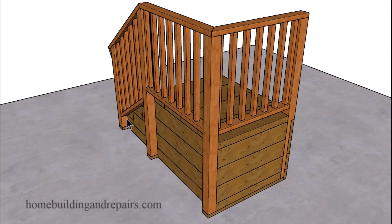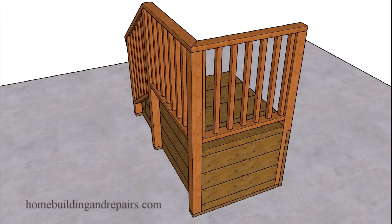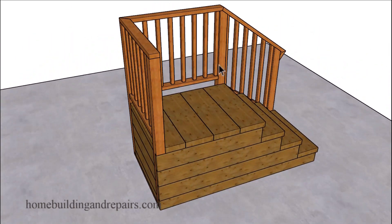We are going to have a set of stairs here with four steps and a handrail. This is not a guardrail — if somebody was to put enough pressure on it there's a very good chance you could flip the stairway on its side. So if you're going to use this as a guardrail you might consider fastening the stairway securely to either a concrete floor or a group of concrete footings.